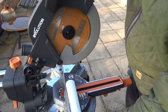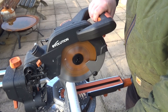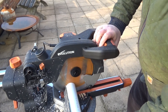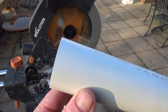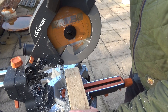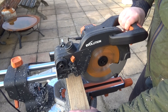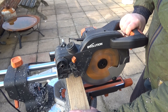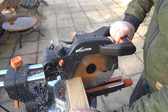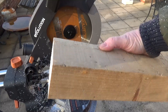22mm copper piping for any plumbers — and I know a plumber wouldn't really consider using a mitre saw for cutting copper pipe, but it really is very quick and easy. And some 1.5 inch ABS pipe — that is a really neat and tidy cut. Then just to show that this blade isn't adversely affected by cutting through metal, I'll cut through the 3x3 fence post again. And there we go — lovely.